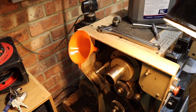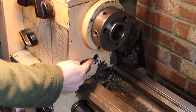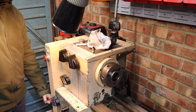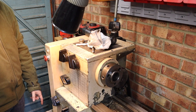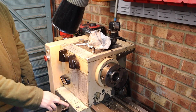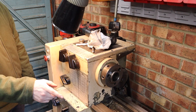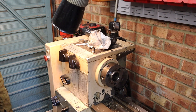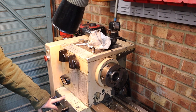I ended up filling that up off camera because it was really awkward. With the headstock oil topped up to the maximum — which we can see in the sight glass — the last oil to change is the gearbox. The drain bung is at the back and we've got the fill plug here. I'm going to do exactly the same: drain it out, flush it through a bit if it's grimy, then fill it back up. This takes a very similar quantity to the carriage. After that we're going to move on to the drive belts, which is really important — one is in really poor condition.